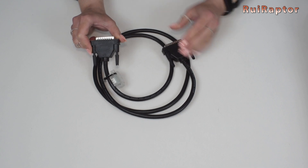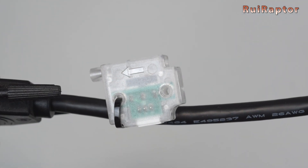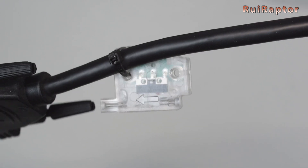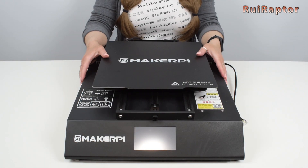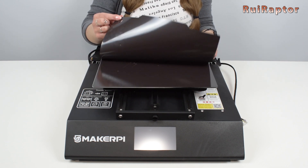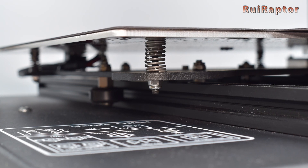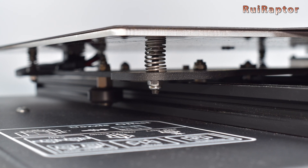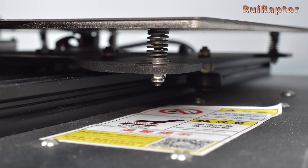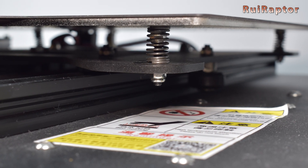And this is one of the two cables that will connect to the heads. On the side that will connect to the heads, they have a filament sensor attached. And this is the base. The print bed is 310 by 310 mm and has a magnetic print surface on it. Under the bed are the adjustment screws to level it. The manufacturer decided not to include the traditional knobs to help level the bed, which means that the adjustment needs to be done with the wrench tool, which will not be as easy.